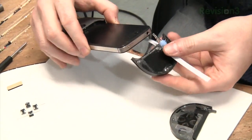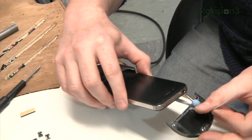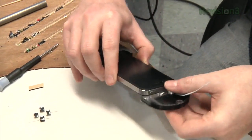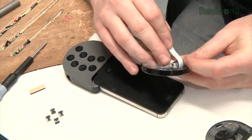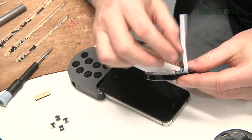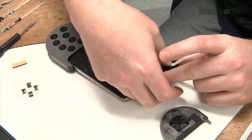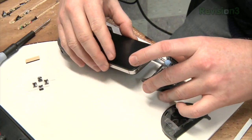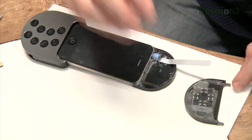We're going to get ready to do the final wiring here. It's very important to make sure that we can take this apart, so we look at the length of this cable and make sure it's long enough to reach this plug but not be too tight — there basically needs to be some slack. We'll glue that in place with enough slack, which would be right about there. Hot glue — our dear friend and benefactor. Then we'll wire this to our D-pad control and we'll be ready to rock.